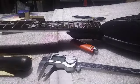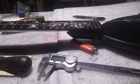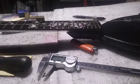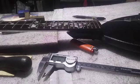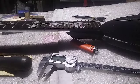Okay, I loosened up the neck screws, and that allows me to slip shims up in under there and test stuff out as far as where it leaves the strings. The strings are not at tension, but when the bridge is in there, they're tight enough that you can see what's going on. By doing that and trying a few different things, I came up with about 4 millimeters. Looks to be a good first guess. At least good enough until I get all 6 strings on and under tension, and then it might need to be sanded down a little bit, maybe something like that.